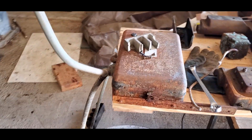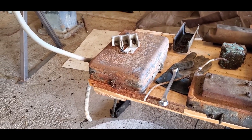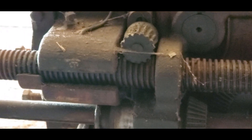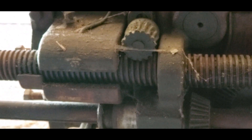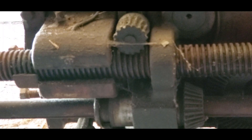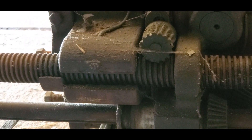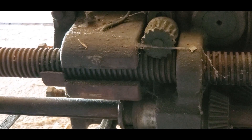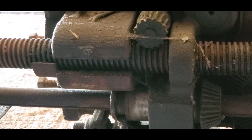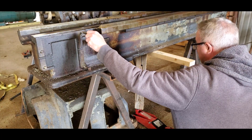We've got the electrical system over here that needs thorough cleaning, but inside is basically just fine. I think it's pretty good on the backside of the lathe. I forget what you call the dial that tells you when to engage your half nuts — the word I was looking for was threading dial. I thought that thing was really worn, but the teeth on it are pretty good. I'm really crossing my fingers hoping the half nuts are in good shape under there. They're kind of stuck, so they're going to need to get freed up and get that threading screw out of there.